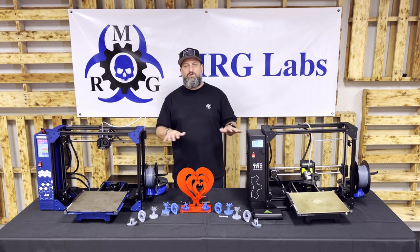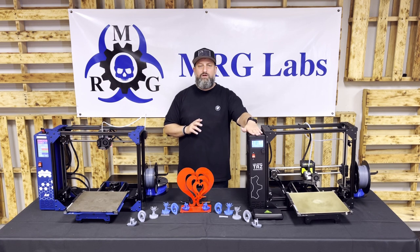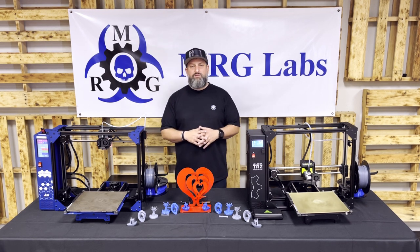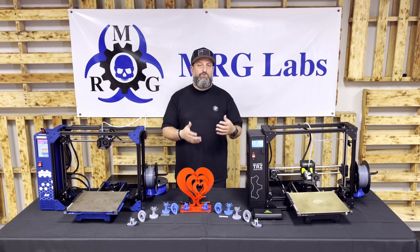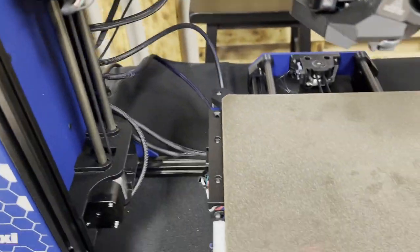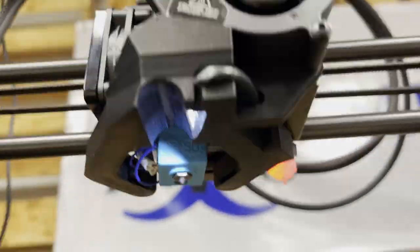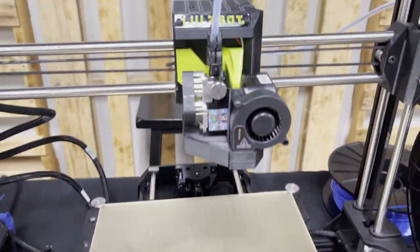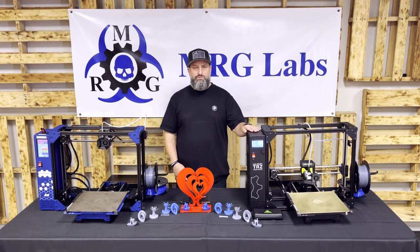The startup speeds of both of these are relatively similar, although the bed on the Workhorse did heat up much faster than the Axie. The Workhorse can't handle higher resolution though, as it's got a bigger nozzle at 0.5mm, but therefore it can print a little quicker. Once you take these into account with the time savings and the leveling of the Workhorse, the overall time is about 20% faster on the Workhorse than the Axie on average, albeit you will sometimes not have successful prints if you're going for higher resolution. The Axie can achieve higher resolution prints because it has a smaller print nozzle at 0.4mm. The most visible difference once prints have started is the Axie tool head has a window cutout and a blue shroud to allow for easier visibility of print progress, as well as an LED light under the print head. The Axie movements are also much quieter than the Workhorse due to a 32-bit controller on board, instead of the 8-bit controller on the Workhorse.